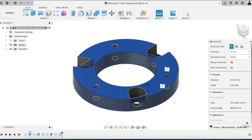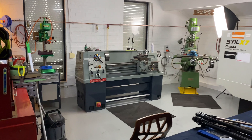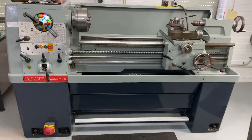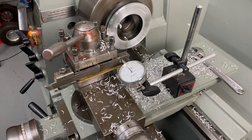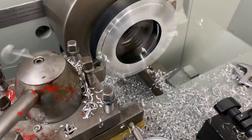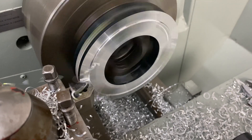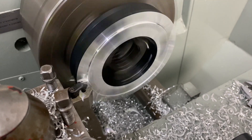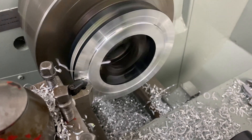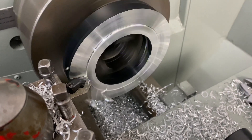Let's jump into the workshop and modify these today. Here's my little home machine shop and you can see I've got quite a few selections of machinery here. Once clocked in the three-jaw chuck we just took numerous cuts at one mil depth of cut and faced that down. This stuff machined like butter — it had a very unique smell to it, and I'm starting to wonder was it a cast product, no doubt originally manufactured overseas.